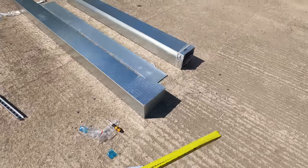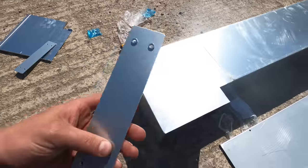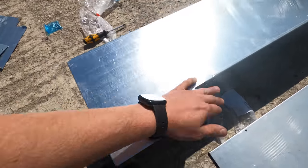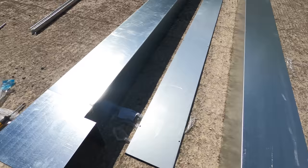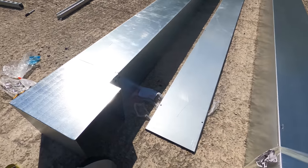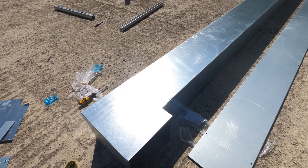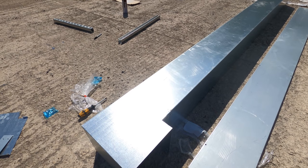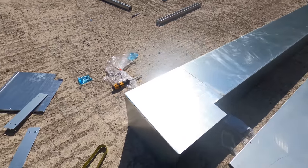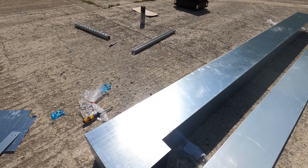So this is the trunking we're using, big 9-inch stuff. When you get to this sort of size, instead of bolting it together, you have these brackets which do that for you. So yeah, wholesalers have done a nice job of scuffing it up for us, but we should be able to make good at the lids. We got another length in the other unit as well, but yeah, we are just over 125 edge to edge of our panel. We're going to go tight. We're not going to be bushing through the side, but if we go tight, it will allow anyone in the future to bush through the side. So we're going to be literally tight to either side of the MCCB board.